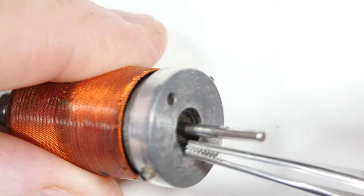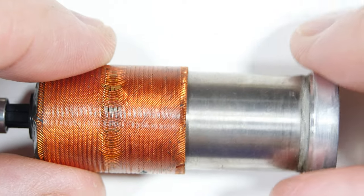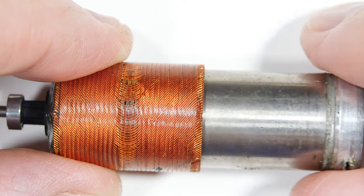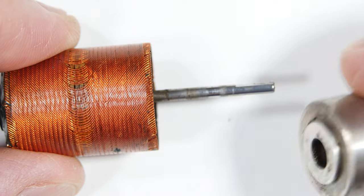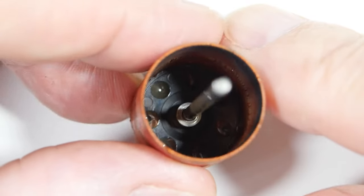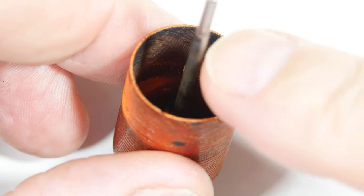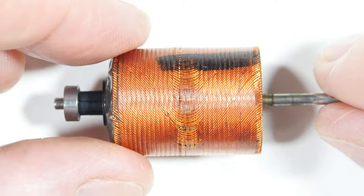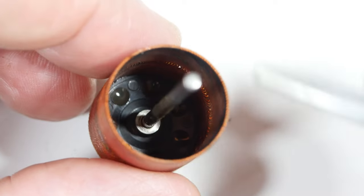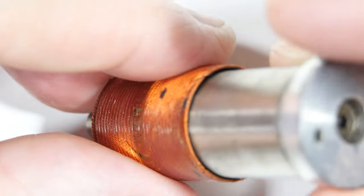On this end there is actually a ball bearing race. What's interesting is that's the magnet — even though my tweezers are stainless steel, it's very powerful. Just a very powerful cylindrical magnet. The shaft's rotor is literally a wire basket that has been very carefully woven — it's beautiful. These are the windings, and the clearance between the rotor and the magnet is almost zero.